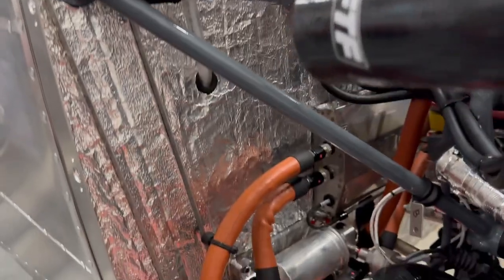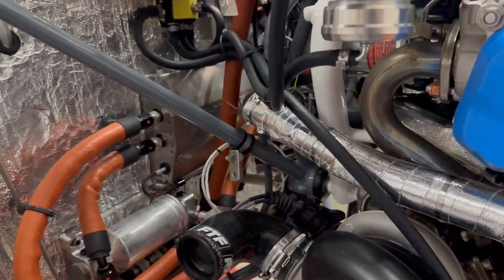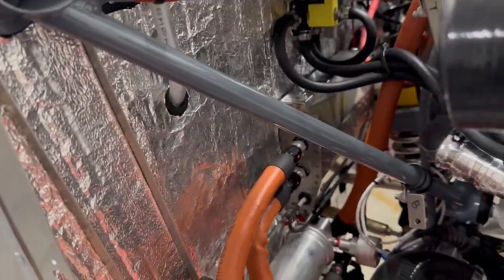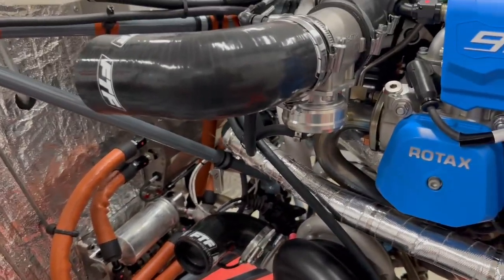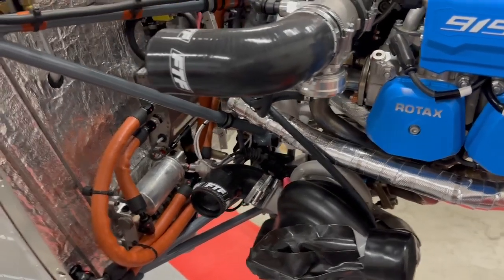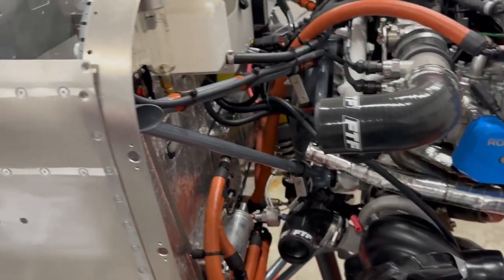So like I said, all of these fuel lines are now done, and really not much else I can do here. Electrical, coolant, oil lines. These lines are permanent. They should never need to be replaced. The oil lines I mentioned before, those do have a 5-year lifespan. I chose not to put the PTFE in there because they are open and more accessible.